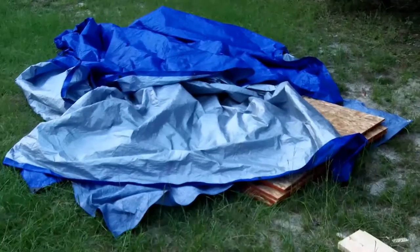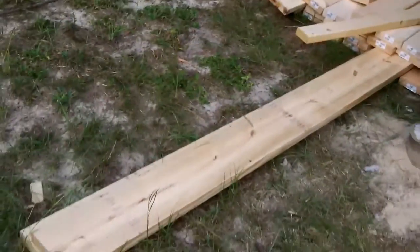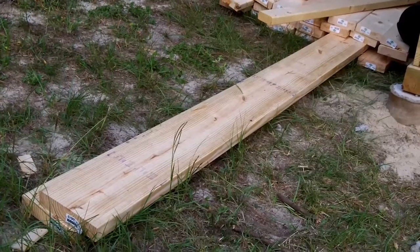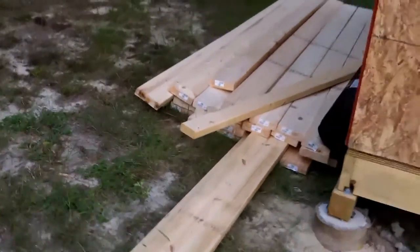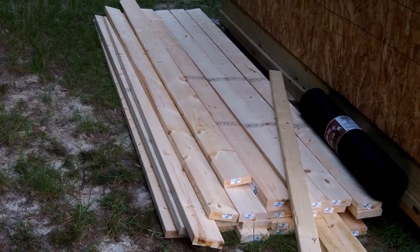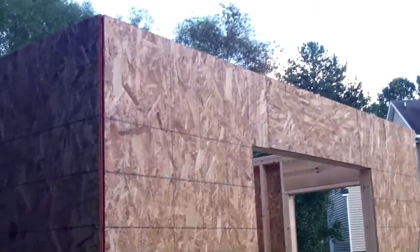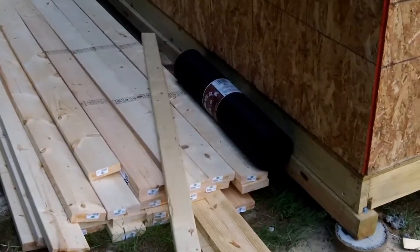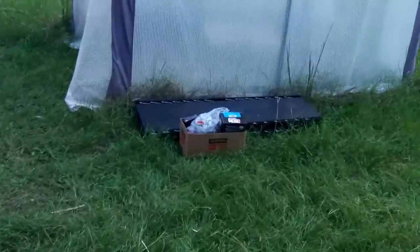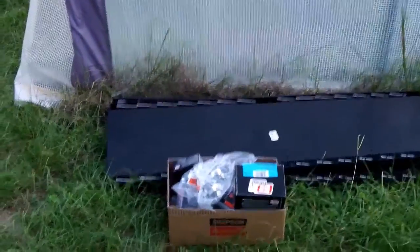Next up is the roof. I've got my materials out here: some OSB for the sheathing, two 2x8x16s that I'm going to cut to 14 feet — those will be the ridge beam — and then all the rest of these 2x6x10s that I'm going to cut to about nine feet for the rafters. We'll have some overhang on the gable side and the other side. I also have my felt paper — it's not really tar paper — and some miscellaneous roofing things including ridge vents to help ventilate the shed. Next up will be the shed roof.